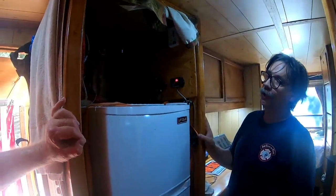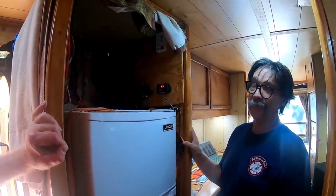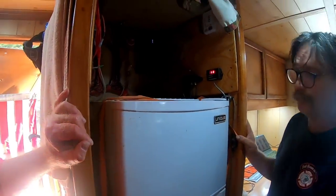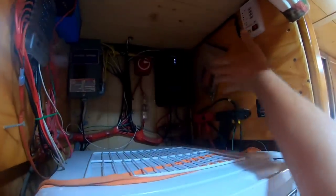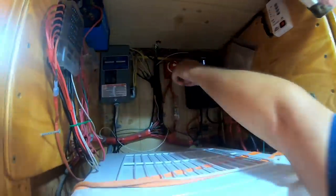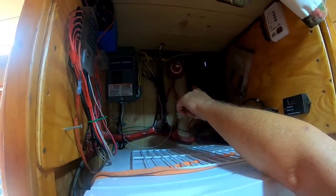So my refrigerator - I cook everything I eat and I don't like going to restaurants, so I needed a big refrigerator. This one is unique - it's a solar refrigerator that works on either 12 or 24 volts, and I have it hooked up to my 24-volt system. Here's my electrical closet - this side is 24 volts, this side is 12 volt, that's 110, and that's the charger from the roof. Everything comes through isolating circuits so you can turn everything off and isolate everything for maintenance. There are circuit breakers on everything in and out.